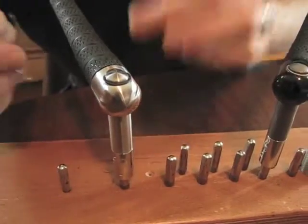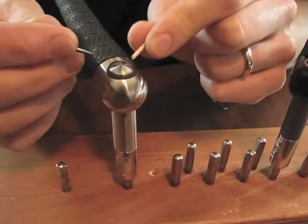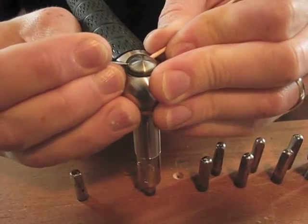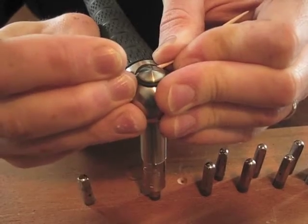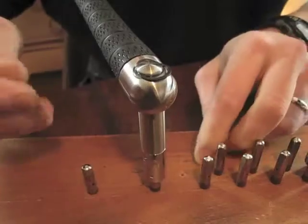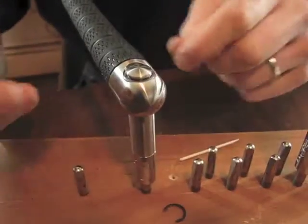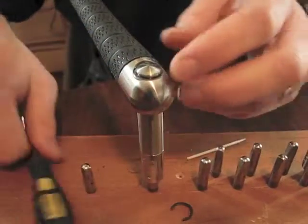Place it on the pin block if you can — that makes it a lot easier. Put the toothpick on one side to grab the clip and move your dental pick just under here, and push straight off. You don't need a huge amount of force. Just work it straight off and then pull it out. Note that you can fling that clip across the room if you don't have your finger there on the other side, so just make sure that's there as well.